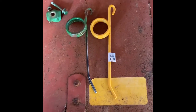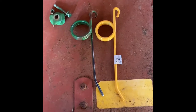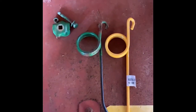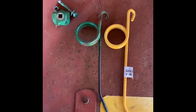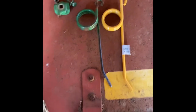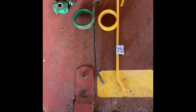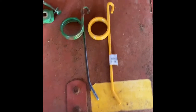Where New Holland used carriage bolts. So if anybody out there is working on a 64, 74, or 75 John Deere rake and you're wanting to go with the steel teeth like these instead of the rubbers, you can run the New Hollands without any modifications. Just have to go to Tractor Supply, Co-Ops, Agri-Supply, any of those type stores, and pick up the New Holland teeth and they'll fit right in the clip.